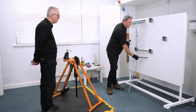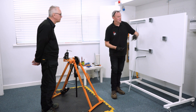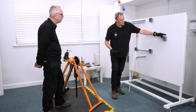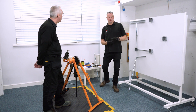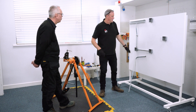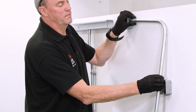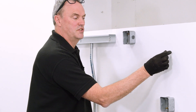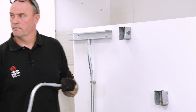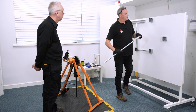So what I'm going to do next is adjust that for the fact that we need to put a coupling on there. I'm going to cut it, thread it, and it should just fit perfectly. The question is, do we fit a saddle or not? That depends on the distance between the two points. In this particular case it's only a small section and when these are tightened up it will be quite a good mechanical and structural fit. If you wanted belt and braces, you probably could put a saddle there. I'll cut that, thread it, and fasten it up.